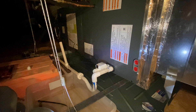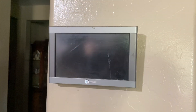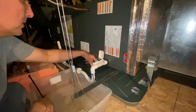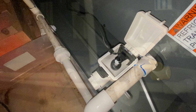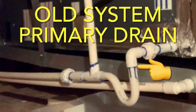It's only been a couple months since we had that installed and we just had our thermostat kick off. When they installed this unit they said they had put in an updated system as far as the drain goes — it actually has a float switch on the secondary drain so that if it senses water it shuts down the AC unit.